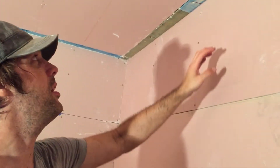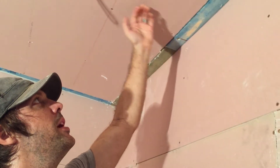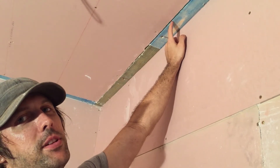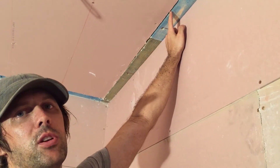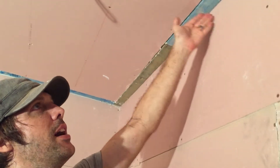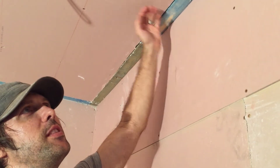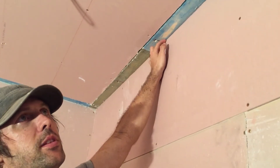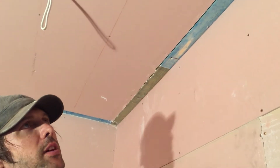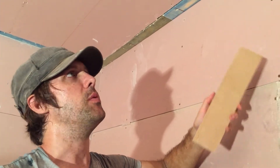Here's the next little problem. You might have noticed up around the top corners of the room there's this blue border — that's not really supposed to be there. In an earlier video I described the way the plasterboard from the ceiling was going to meet directly with the plasterboard from the walls, but we've got this great big piece of wood in the way. My builder Dean, in order to put the room up very quickly, prefabricated the walls and also prefabricated a special beam with pre-cut joist segments. That meant the plasterboard had to stop at that beam. I can seal it up so there's no soundproofing problem at all, but cosmetically it looks a little strange. All we need to do is put a little cornice in later on just to make it look pretty. We had a little panic about it first, then realised it's really no big deal.